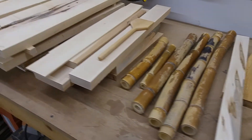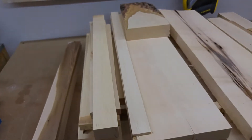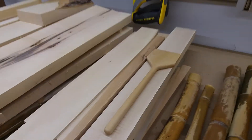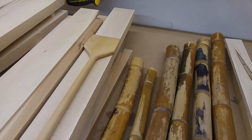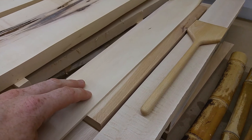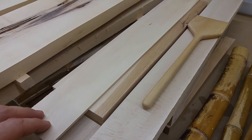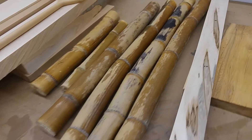What we're going for today is not just kiln-dried wood — we're going to thermally modify the wood, or bake it until the actual cellular structure of the wood changes. The advantages are that thermally modified wood will first become a little bit darker, so maybe this piece of beech would end up looking like that piece of maple there — that's a nice aesthetic benefit. Also, when you bake the wood to those temperatures the fibers shrink down and the wood becomes more dense, making it more water resistant. Additionally, any sugar and starch inside the wood — which is exactly what bugs and insects go in there for — is no longer going to be present.